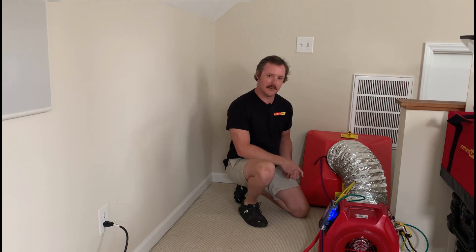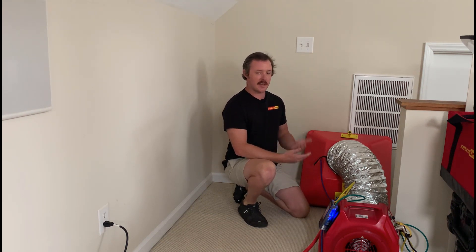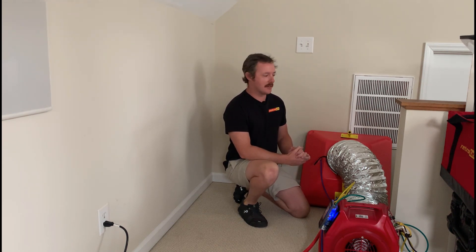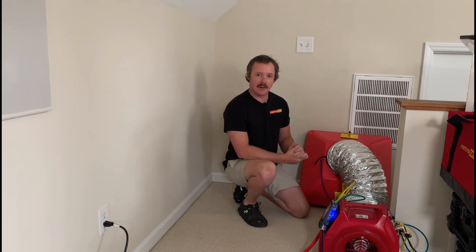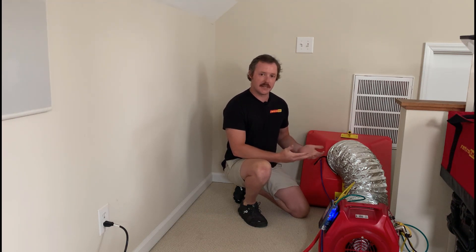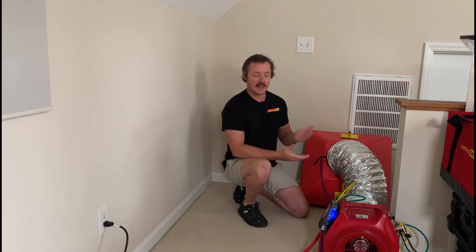A little extra background on total system airflow and why we care about that. This is about a 2300 square foot home served by a three and a half ton heat pump. My good friend Steve Raritan came out to go through the system, hooked up Field Piece Bluetooth probes, and used MeasureQuick. We went all through the system to see why it really wasn't managing humidity the way it should — even though there is some air leakage in the house that doesn't help, we could tell there were some other things going on as well.